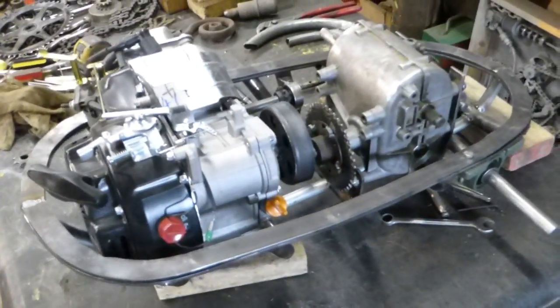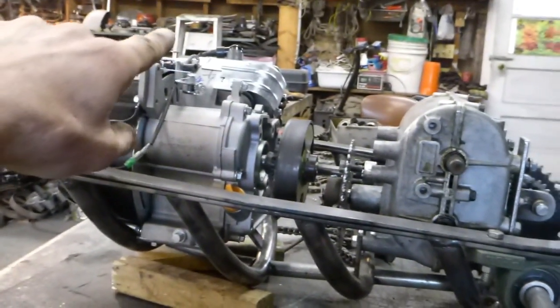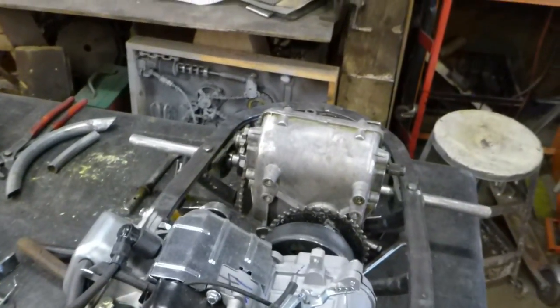The first thing I did was make cardboard templates for the legs, because to build this thing I only really needed two measurements — the height from the belly to the shoulder pivot up here, and the distance across. That's like eight and eight and a half, and then seventeen and a quarter or something from there to there. I made the cardboard templates and just kept making circles on the floor with chalk for the foot, so I could see where the range of motion would be for the legs. I just picked the best one that I thought would work best.